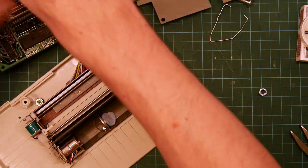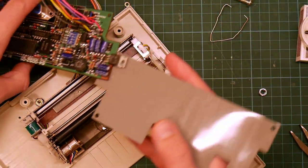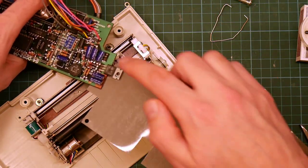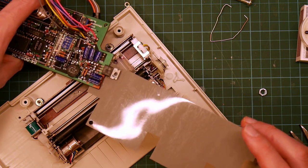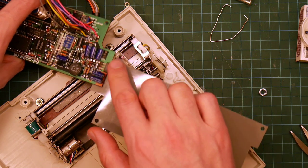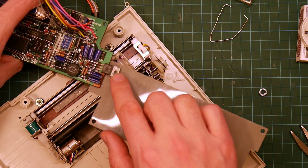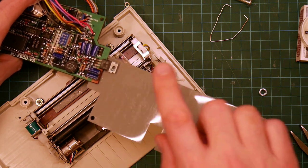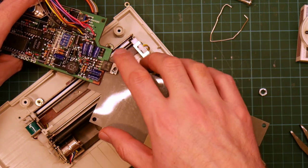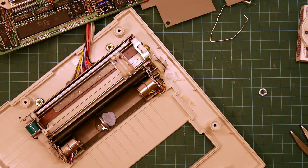And that's to deal with the power supply issue, because I mistakenly removed one of the regulators from the board, made a bit of a hash of it, and lifted some pads. The other regulator is also a linear regulator and I don't like these — they get really hot, I don't like that it needs a heat sink. Just running this thing on the bench without the heat sink attached, it's been getting pretty warm. So I'm just going to replace them both with modern buck regulators.